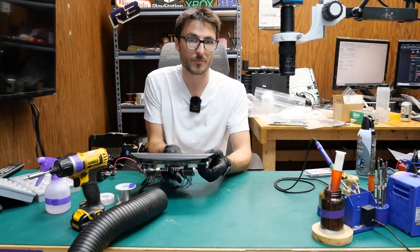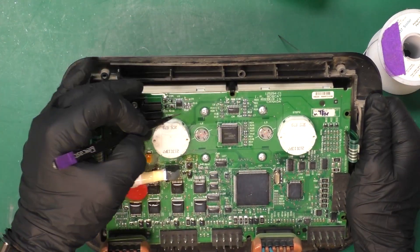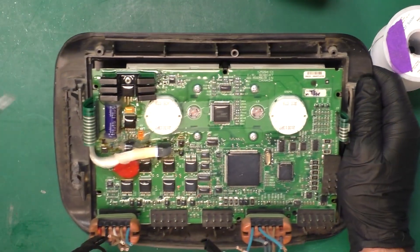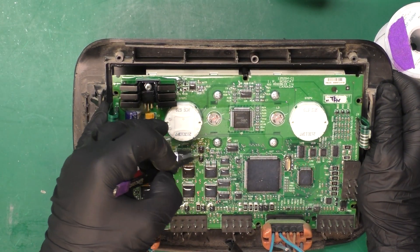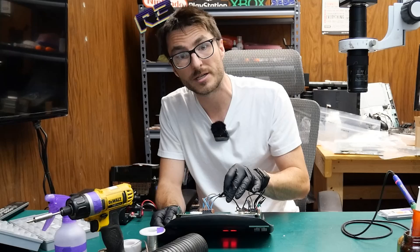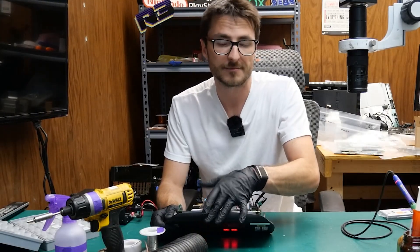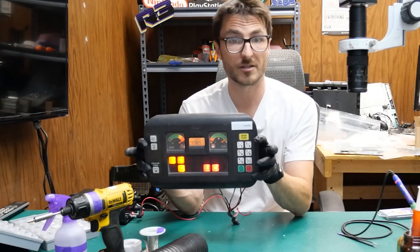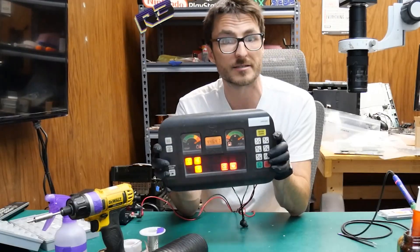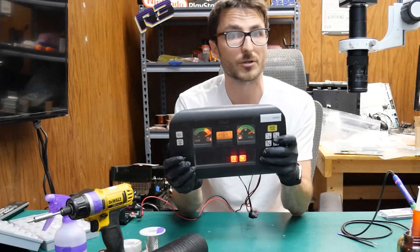However, we are not done yet, because this entire area — we did not replace any resistors. When we see these other groups fail, we typically see some of these also start to go bad. With the multimeter they were measuring within tolerance, so technically we don't need to replace them, but if we don't replace them today this unit may fail in the next year or two. We want to make sure that when we send these out they work for the next 10 years. We'll go ahead and do that off screen. If you found the video helpful, leave us a like and subscribe for more content. If you have a Bobcat unit you'd like to send in, links to our flat rate services — which come with a one-year warranty — are in the video description below. Thanks for watching.